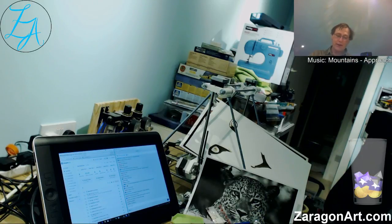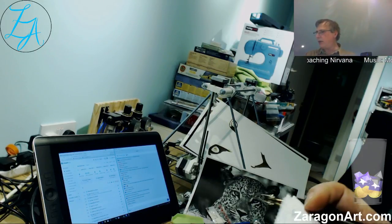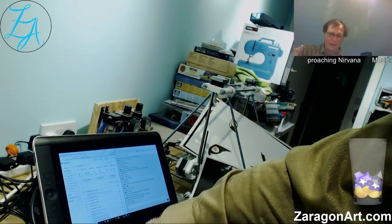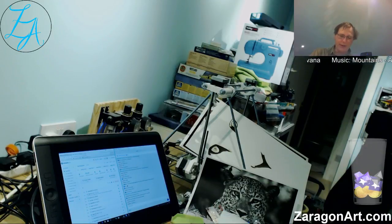When the tip's warm, you can clean it off. It's very, very slightly abrasive, so it will get most of the carbon off. But if you want to polish the tips up, literally get some metal polish. Now, what I use is actually this. Because I happen to have it, this is what I use when I'm sharpening the chisels, and it's more of a honing process, shall we say, rather than sharpening.